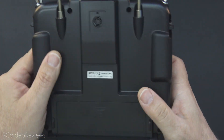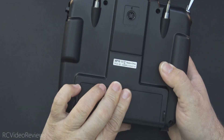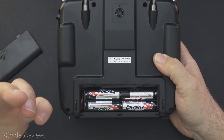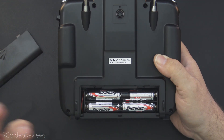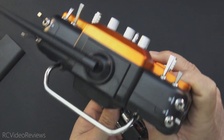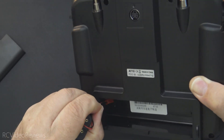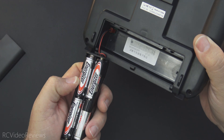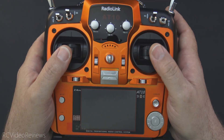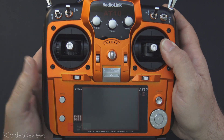When you move the sliders and let go, they stay where you put them. I kind of like that lever feel. On the back of the radio, there is no module bay for an external module. The handle is solid metal and does not fold down. The biggest disappointment is internally it takes eight AA batteries. I'm sure that's fine for power levels and flight time, but I really just prefer a rechargeable battery. They also use a standard JST plug with no latch, so it just pulls right out. Overall ergonomics in the hand are fine, but I'm really not a fan of the gimbals — they feel cheap.